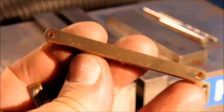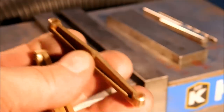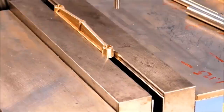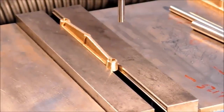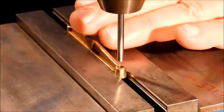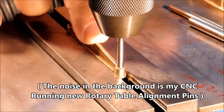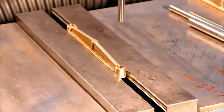Make sure that you wipe it back across the emery when you are done drilling the holes, because this material will crown when you drill it — deburr it as you go. Flip it back over, get some pins — I'm going to use a pin in the drill chuck to line up this hole, come down from my zero, and spot face from there. For sake of cosmetics I decided to do the initial through hole from the bottom, so I'm going to use a 0.140-diameter pin in my drill chuck to pick up the existing hole and find its center.